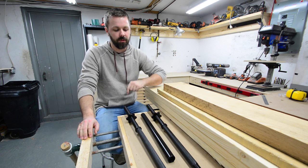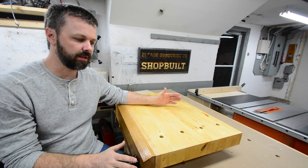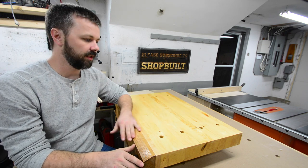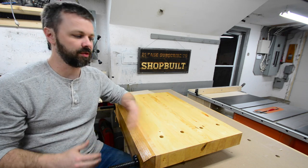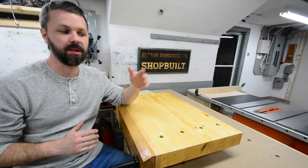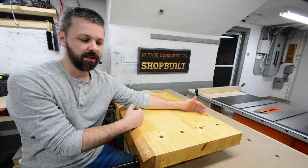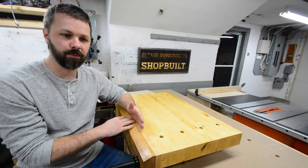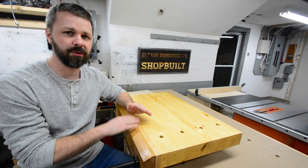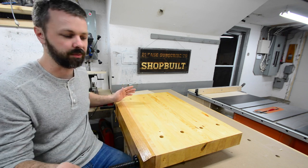You can get this stuff used if you were to look. Once you have the style of vise you want to make and the hardware picked out, the next thing is material. Obviously the best material would be hardwood through the whole thing, but a lot of us can't afford that, including myself, so I'm using construction grade material for the top. For the vise material I did use hardwood — just hardwood I had in the shop — and I think it's important for the vise to be hardwood because it takes so much abuse; softwood probably won't last that long.